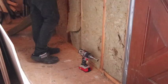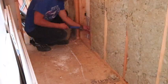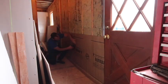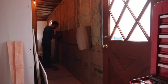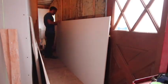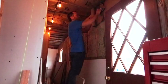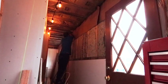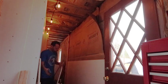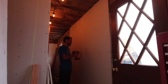Can't forget to put the lag bolts through the framing of the house. I think I missed one — over by the hot water heater in my bedroom — so I'll go back and put a screw-type bolt from the frame up into the house; it'll be good enough. It was nice to get the hallway finished with drywall — makes it a lot lighter in there. These pieces were easier to put up since there were no electrical receptacles or light switches in the hall, so it was just cut to size and put them up.